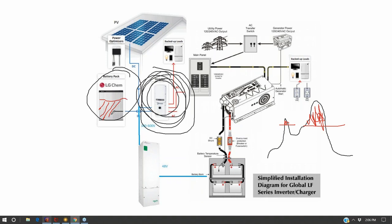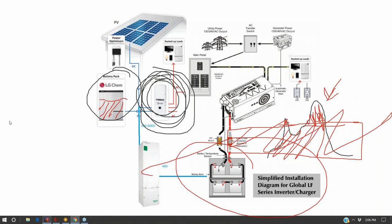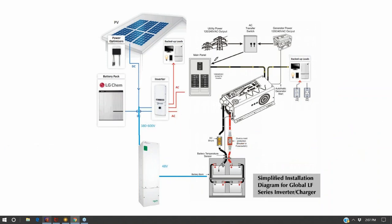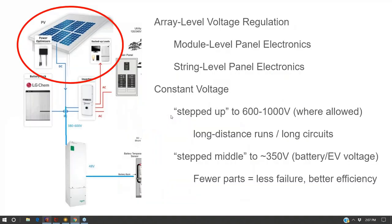That lithium ion battery is only being used for spiky loads. And what that means is the lead acid battery is being used for longer, flatter, rectangular loads, as it should be, as what will get you to that C20 discharge rate, which will get you longer life, better performance out of your lead acid battery. And so here, just by reprogramming the inverter, we have infrastructure for backfeeding the grid today, giving us backup power today, and also for converting to off-grid and actually making better use of that lithium ion battery by having a lead acid base and a lithium ion topper. So the question is, will it work?